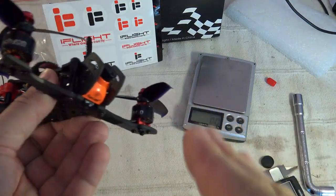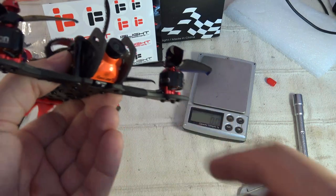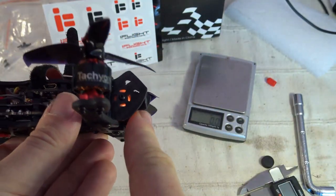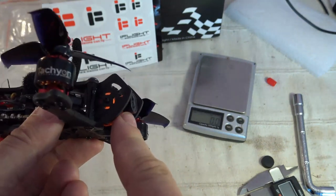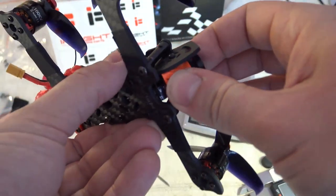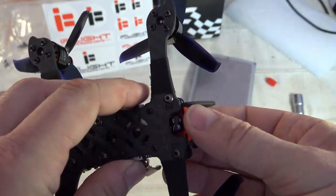So what happens in case of lateral frontal crash? A lot of stress will be here and it will probably break here. The notch inserted into the bottom arm will probably break. But at least, whatever, we will check that. Not necessarily, look, when you are at a very low tilt angle, the lens is a little bit exposed to frontal crash, but with a very high and aggressive pitch it is not really the case. So be aware and be gentle when you manipulate, because you have this ribbon cable from the Runcam Split Mini, and it is known to be a little bit fragile.